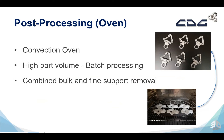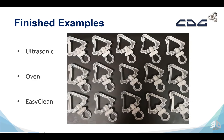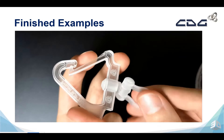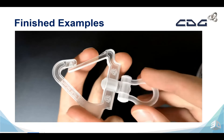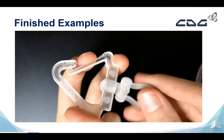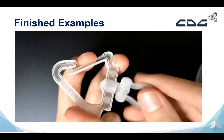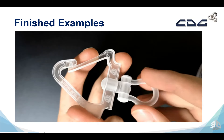The other method is using an oven. This is good for batch processing — we can put lots of parts into an oven, melt all the wax off, take them out, and wipe off the surface wax. This is really good for bulk removal of support wax, especially for big parts that have lots of wax. Looking at some examples, we can see the differences between the ultrasonic, oven, and Easy Clean — they all look very similar in finish as they all do a very similar job. This is the part being sent to you — an example assembly part with a moving element, a flexing part, and entrapped wax. You can see the 3D Systems logo and the ProJet 2500 label, showing that you can have entrapped labelling within the part.